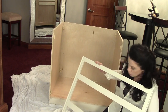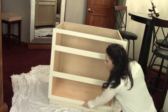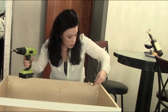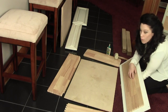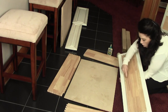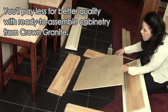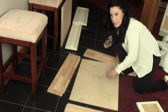Now it's time to install the face plate. On the back side I have three grooves that are going to fit into all three surfaces. I'll get everything lined up and screw in from the back side with the brackets. Then I'll take the large brackets and reinforce all four corners along the top. To make a drawer you need a base, three sides, a front, a little bit of glue, and a rubber mallet. These all have a dado that accommodates the base piece — it's a nice quarter-inch thick piece that fits inside the groove. Let's start gluing and getting them together.